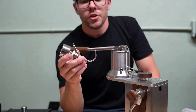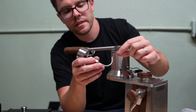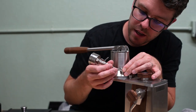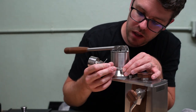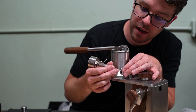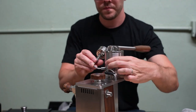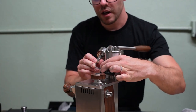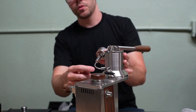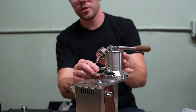This is all pre-aligned before we send it to you, and these tubes have a small chamfer on the end. We'll take our finger and push in this little push button, then slide the tube in. You'll think it's all the way in, but it's not. There's an internal O-ring, and the whole point is we want this tube to get pushed into that internal O-ring. The chamfer on the tube helps lead it in, but you'll need to push it through.